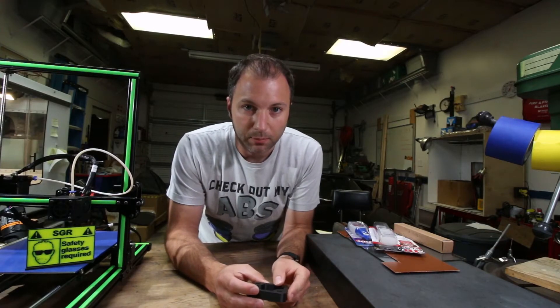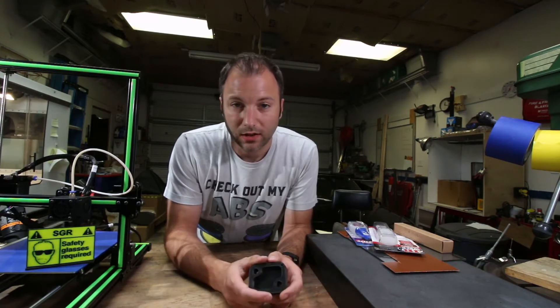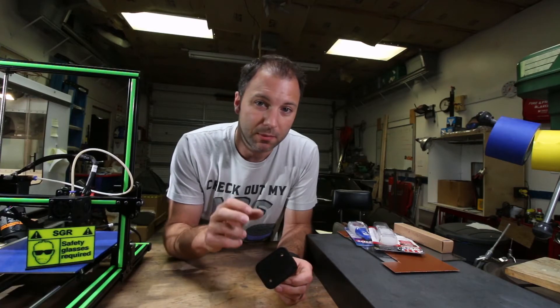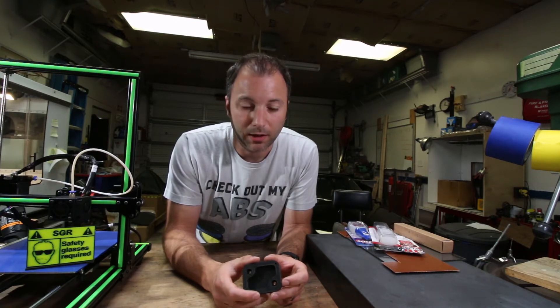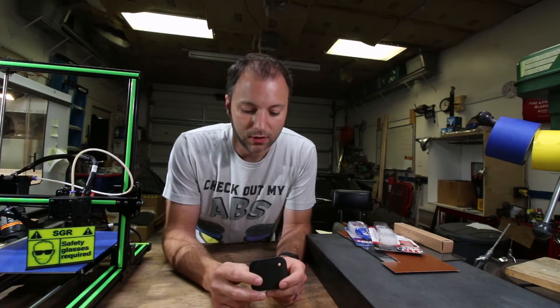I've been doing a series of videos on 3D printing nylon — one where I made a 3D printed car part out of nylon and did some generic testing showing how impact resistant it was. I also did a video on how to build a dry box that you can use to keep your filament dry while 3D printing nylon. That's a pretty key tool you need when 3D printing with nylon, just because it's so hygroscopic. It absorbs so much moisture while printing that by the end of a long print, nylon will have absorbed a significant amount of moisture from the air, especially in a humid environment where print quality can start to deteriorate.